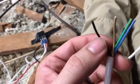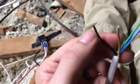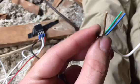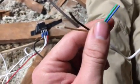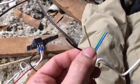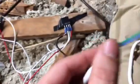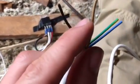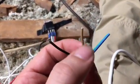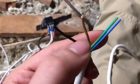This tan wire here is up. This black wire here is down, or vice versa. I don't remember, but it doesn't matter, I think, because once you wire it, if it goes the opposite direction, you'll just have to switch them. But it's important to know that these are basically both hot. These are both essentially black wires, so it's directional. One's up, one's down, but they're both hot.